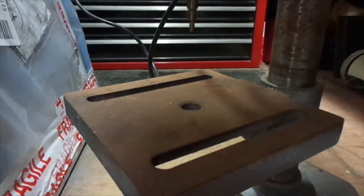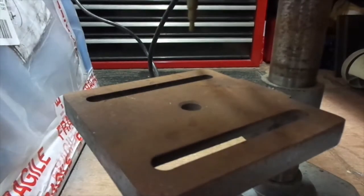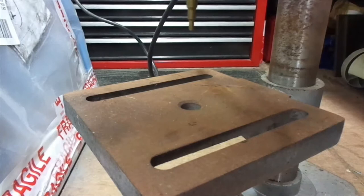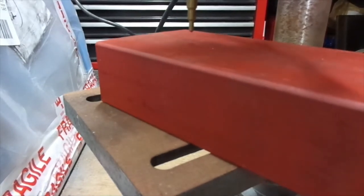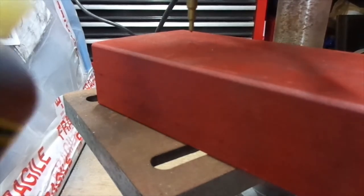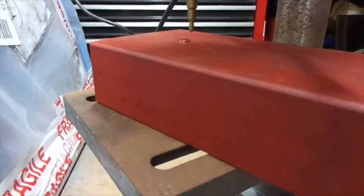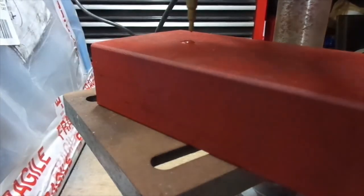Let's find the mankiest drill in the workshop. Interestingly, I am on the floor because there's no space anywhere else in the shed. So it's the small step drill first. Let's see how it cuts through 10mm thick mild steel. But before I do that I think I'll add a bit of lube — it's actually cutting fluid, but lube sounds better. I've got to make sure I line the drill up with this centre-pop I made as I enter.